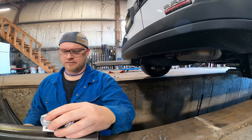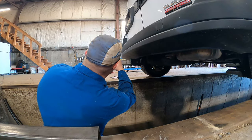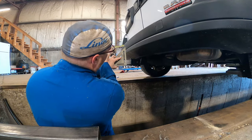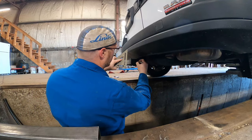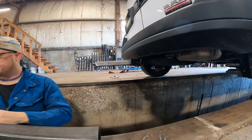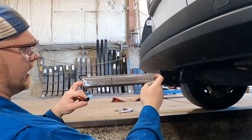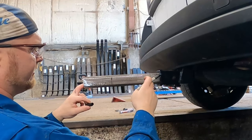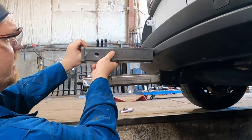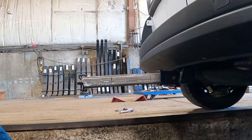That makes sense? 6.5 inches out. That makes more sense. If we find our point back to 1 inch, that's where we'll drill our pin. And that makes the most sense to me. So pin, and then this is our gap here to give us our spacing. And then we'll have a receiver here, which will be up like this. So it'll be 1 inch away. So that should give them enough clearance so that nothing should hit.